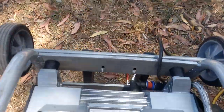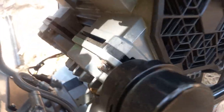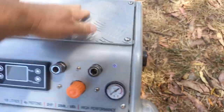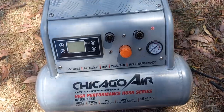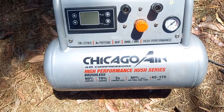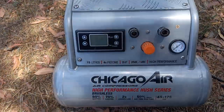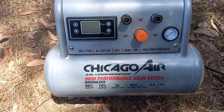As you can see, it can run in all different positions. It's a four-cylinder but a two-stage design, and the plumbing and everything is pretty simple. It's an inverter compressor, so what that means is it's got a capacitor on it. You don't get the initial fire-up speed that you'd need with a standard large-scale two-horsepower compressor — this one just ramps up.